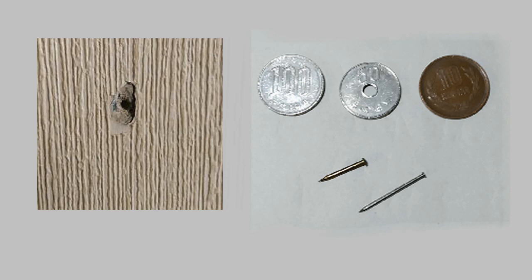Small thin nails like these are sufficient for concrete walls because it is a solid foundation. The nails will not sag even after a long period of time. But in case you use a typical wall made of plywood or gypsum board, it won't be able to withstand the weight and the nails will sag towards the bottom. The hook on the head is also small, so the string will fall off the nail.